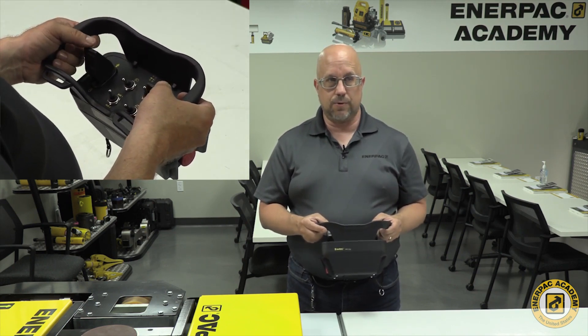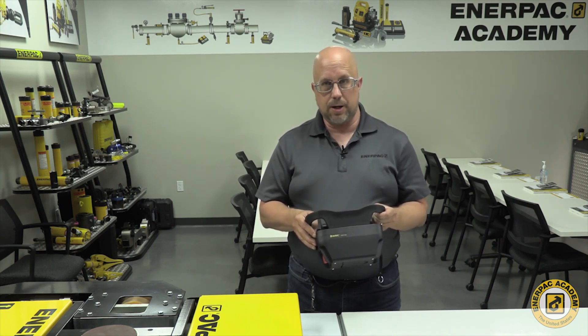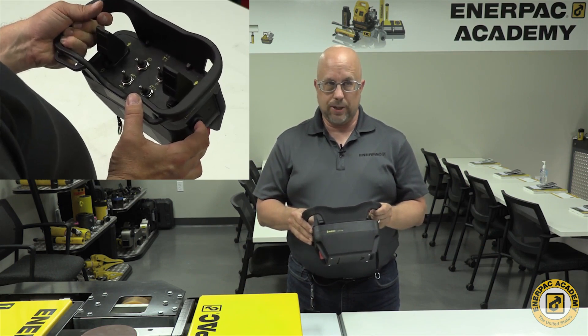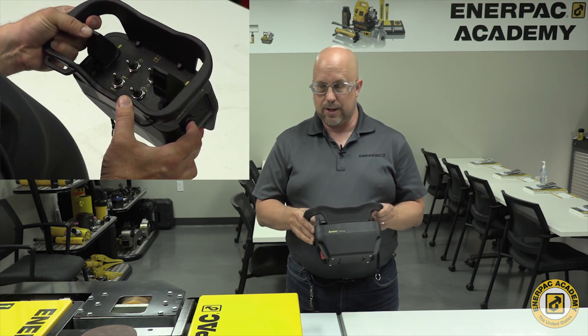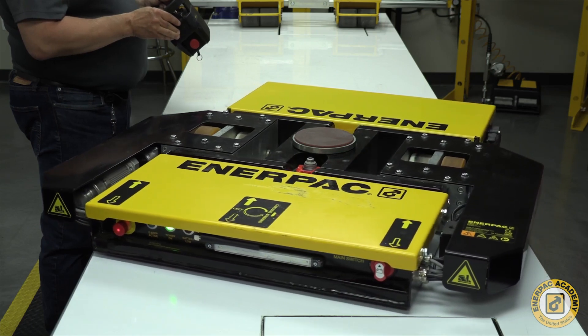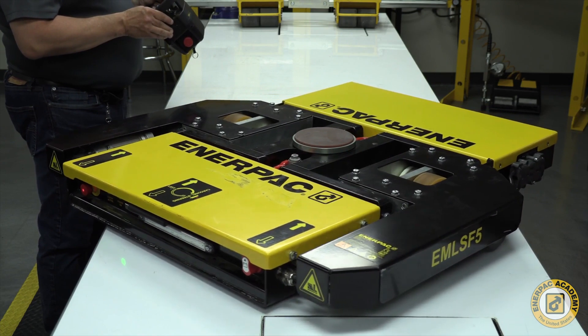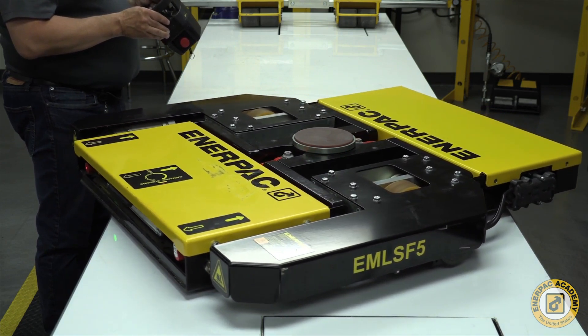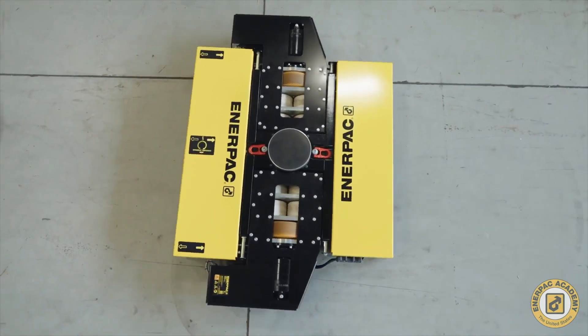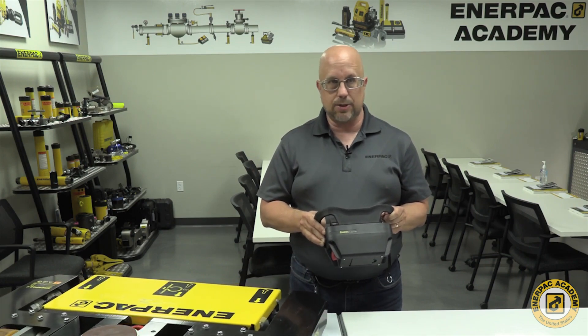To perform a tight turn of the E-Mover, you can enable carousel mode. Do this by pressing and holding the carousel button on the right side of the controller. While holding this button, operate the left lever by itself. Pressing the lever in carousel mode will synchronize the two motors in opposite directions. Note the solid and open arrows on the unit and on the controller for the direction of rotation. This mode is useful to perform tight maneuvers to point the E-Mover in a new direction while the machine stays in its place.